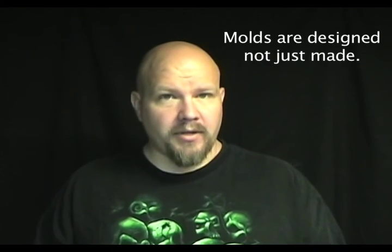We've already talked about making a cradle for the mold, for your sculpture, and what that does is it supports your sculpture, especially large sculptures, and keeps it from compressing the clay and essentially damaging your texture and all of your hard work. But even before that, you should plan out the entire design of your mold, even sometimes before you start sculpting.